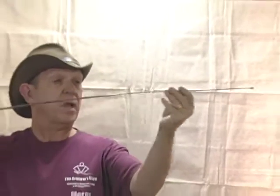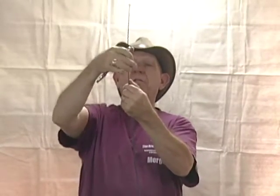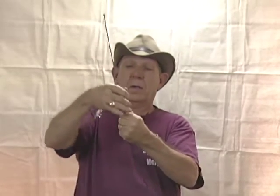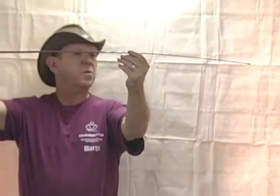As a rule states, there must be one continuous smooth curve for the blade. This one still needs a little bit of work. Notice where I put my thumb, then I put the edge of the crescent wrench on that particular point, squeezing the blade and the wrench together below where I want it. It's a little more bend than I want, so I'll bend it back the other way — there, a nice smooth continuous curve from tip to the tang.